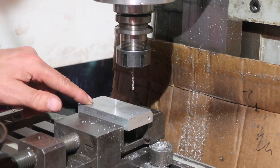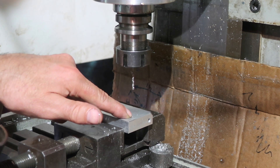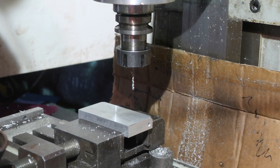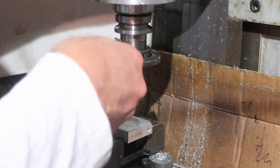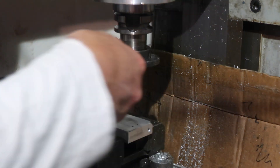Now all that noise is over and done with. We now have a zero point — an origin — we have a hole for setting up the Morse 2 taper, and we have a hole for setting up the 7/24 taper. Let's change collets — change drills.